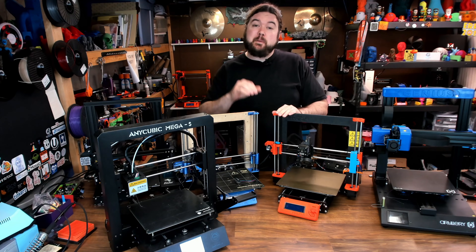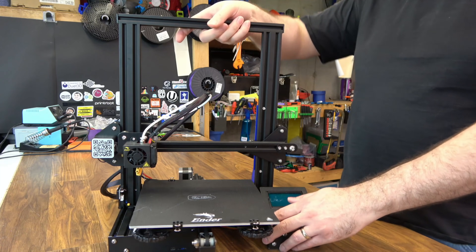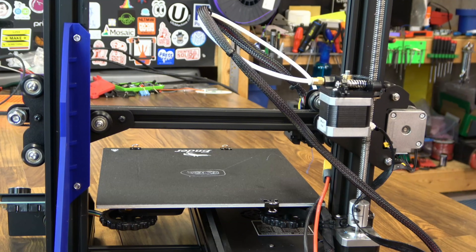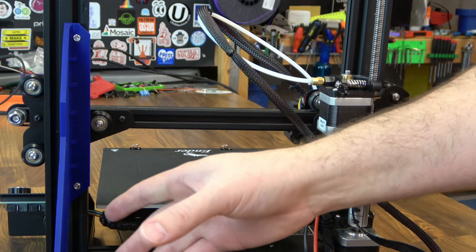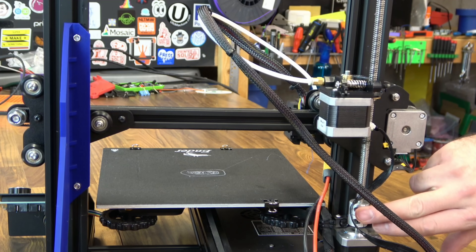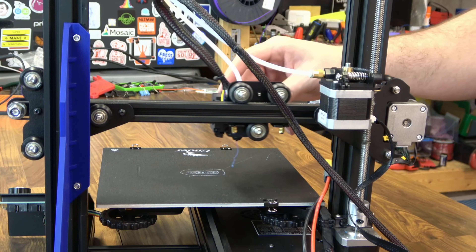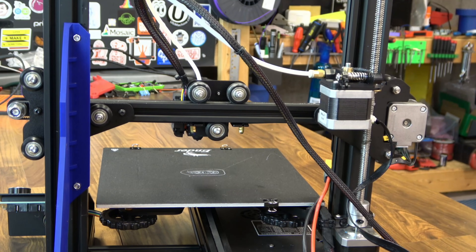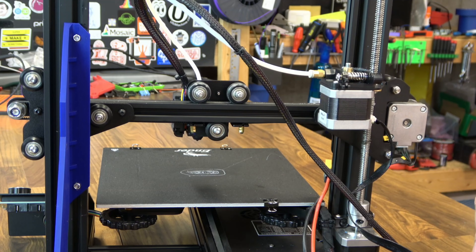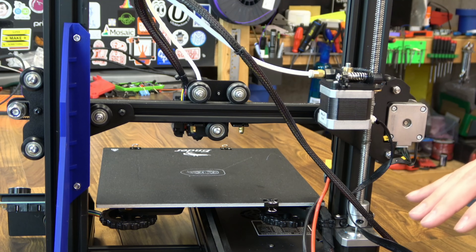Let's get started with probably the most common setup — the Ender 3 with just a single lead screw. Here we have the Ender 3. It only has a single Z lead screw stock. This is the base model. You just have one Z lead screw — a TR8x8 4-start lead screw, so a pretty aggressive pitch. This is a very common setup to see on a more affordable 3D printer. This setup does work just fine, only driving it from one side of the gantry. The longer the gantry is, the more problems you might see. This is also the same way they did the CR-10, which does suffer a few more problems because it is quite a bit bigger.